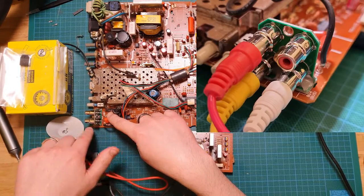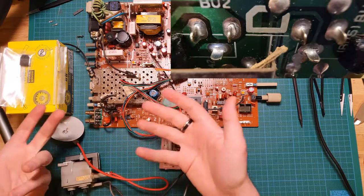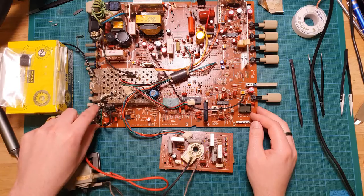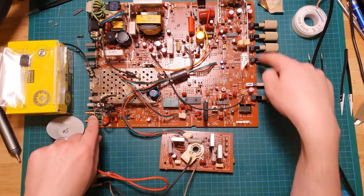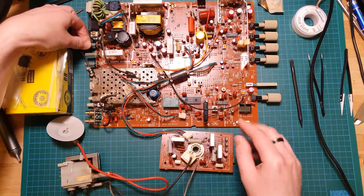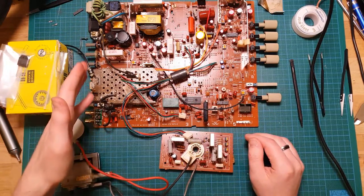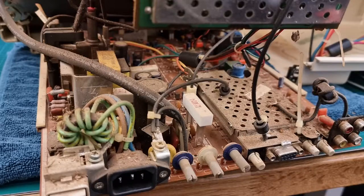But the original connector that was here, the solder joints on the bottom had cracked over age and use, and the customer supplied this replacement to fit in place, and also just to clean up the general connectors. Some of the buttons were a little bit sticky, and these dials had a bit of crackliness to them as you turned them. But once I opened it up, I found that the internals of this were very dusty. It was obviously a very high hour unit.